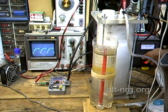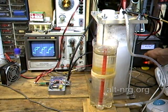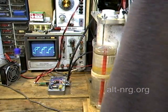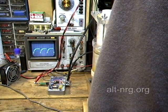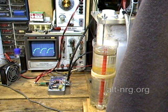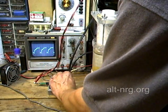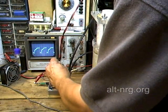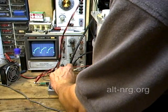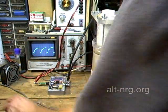As I lower and raise the voltage, when I raise the voltage the pulse duty cycle has to shorten, but the RMS current value is rock steady at twenty amps the whole time. So it's working as advertised, but it's only limiting to twenty amps because the resistance of R12 is too high — it's dropping too much signal voltage for the amount of current going into the cell. I'll shorten it and make it a little bit less sensitive so I can get a little bit more current out of this device.